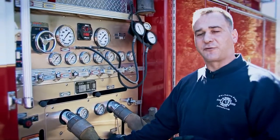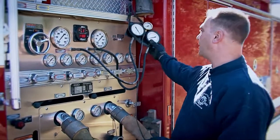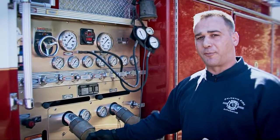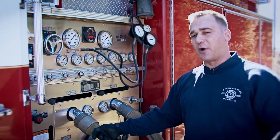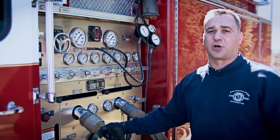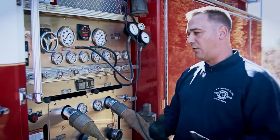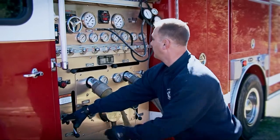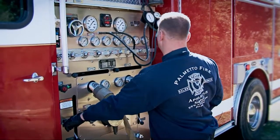One thing I've noticed already, just as I started to throttle up a little bit — I'm not showing any discharge pressure. So we know the truck was not holding a prime very well, so more than likely we've got one or more leaking discharge valves. Not an issue — when you're out actually pumping it, you can go ahead and pull your primer again and get running back to the pump.